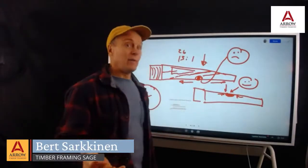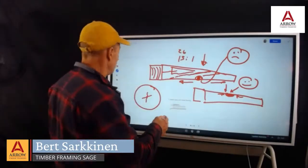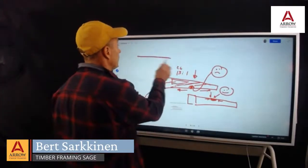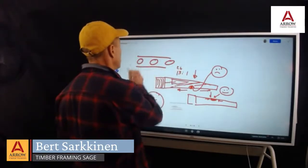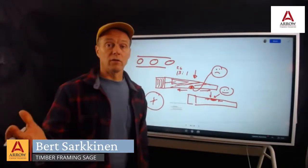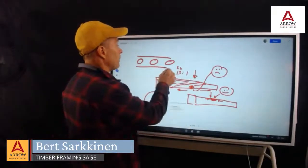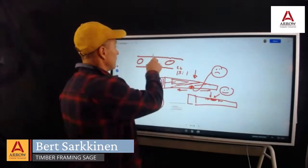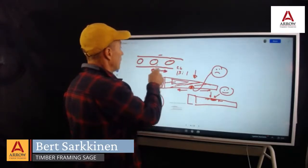A little bit like steel I-beams or I-joists or floor joists, you can take a joist and cut big holes in the center. Sometimes you'll see this even in parking garages. They'll do this sometimes as an architectural feature, for looks, and maybe even to reduce weight. You see these big I-beams with big holes out of the center. And that's not a problem because it's the compression on the top edge and the tension on the bottom edge that is giving it strength.